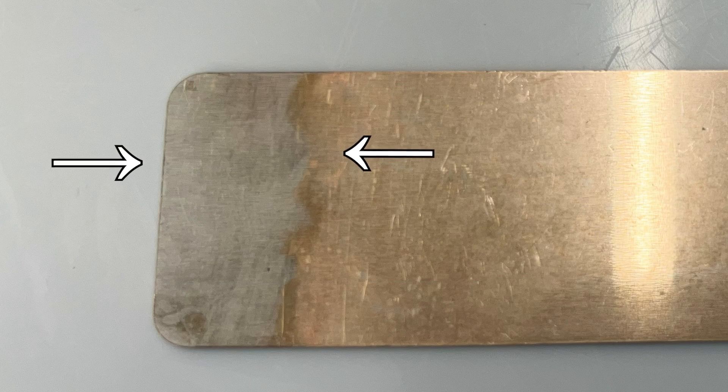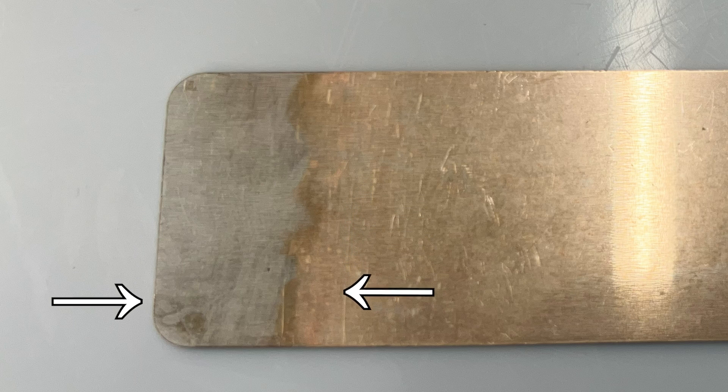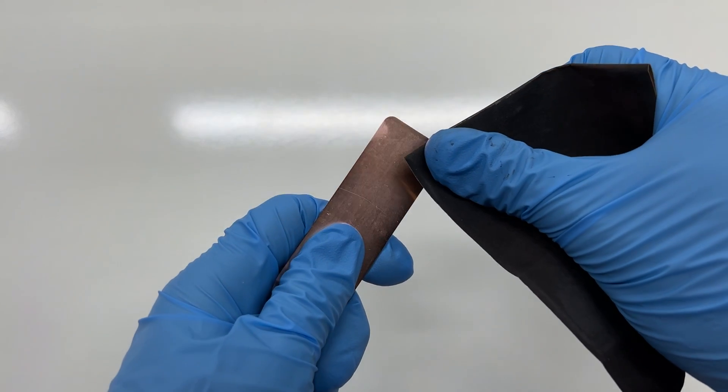And in this piece, you can see what oxidation looks like and how it shows up in the final plate. If a flaw is apparent once a final plate is applied, it is necessary to polish down the piece to the base metal and start over.